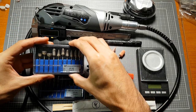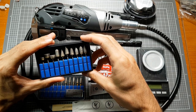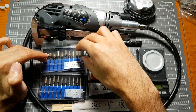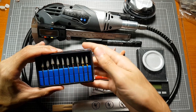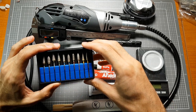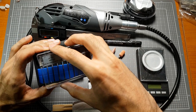As far as bits go, I used to use diamond coated tips for a lot of my cutting. Now I'm using sintered diamond burrs. These here are a kit of really hard and fast cutting ones — they're about 80 grit for the whole set, just a few different shapes. I use that when I've got a whole heap of material to remove and don't really care about chipping — those will burn through it in seconds. This is the kit I recommend for most people if you want to go to sintered: it has the full range of grits, starting at about 80 and ending at about 350 to 400, which is a pretty good span. They cut incredibly fast and are great to get a bit of a finish before going to the polishing stages.